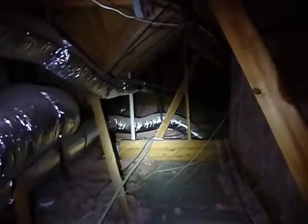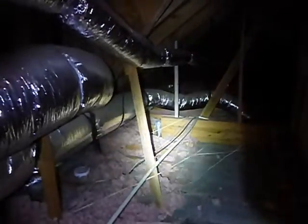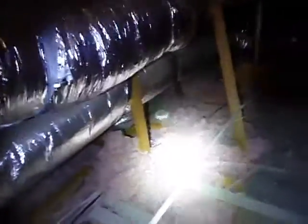We're missing some insulation over there — well, that's another story. Our air duct is not supposed to have more than half an inch of sag in it. There's another one for us. The bathroom vent pipe is venting directly into the attic.